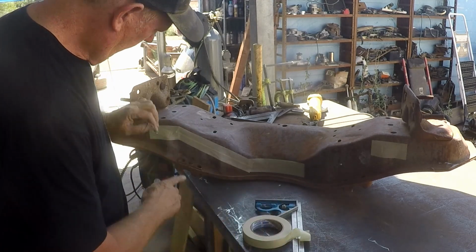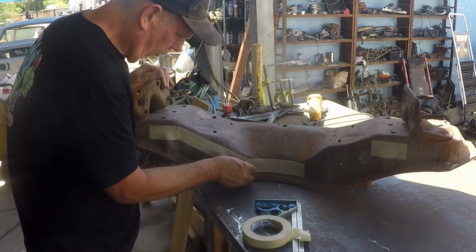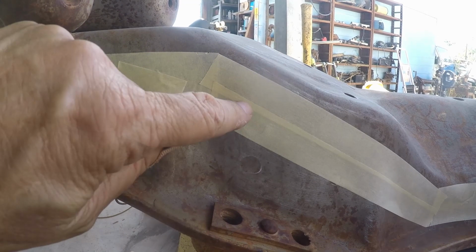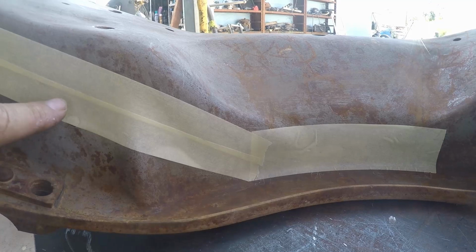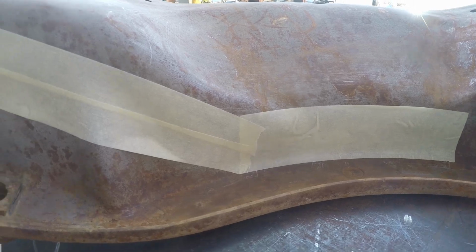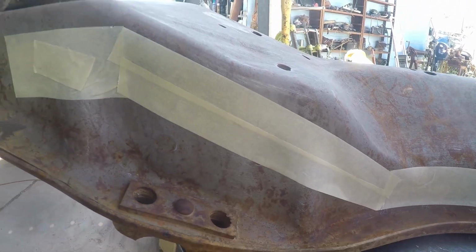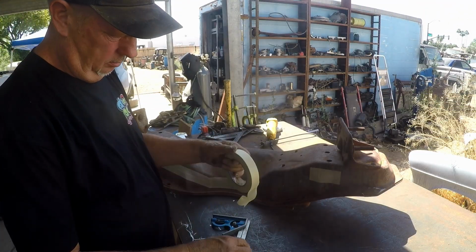All right, so hopefully I'll show you here in just a second. You see there is an overlap. Let me show you. All right, we got 1.88 inches here. As it goes, it turns and this becomes smaller. You see that overlap in there? That's an indication that that is less than 1.88, even though we have 0.94s on it. And then it comes down here and hits 2 inches again. But your measurement is taken vertically, not perpendicular to that line. So that's important, or you will mess it up. You will have a great big gap. All right, let's connect this. I'll quit talking so much.